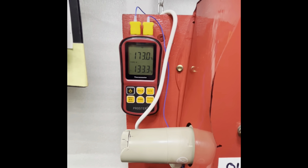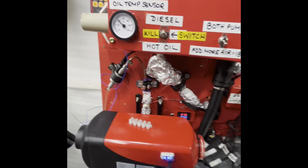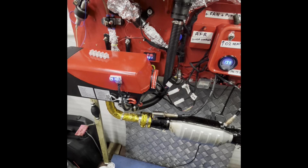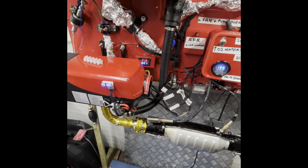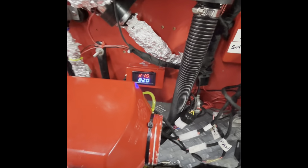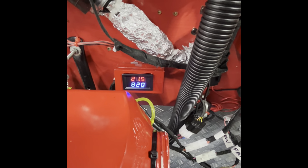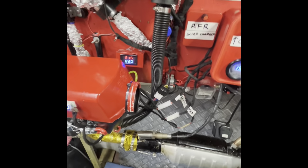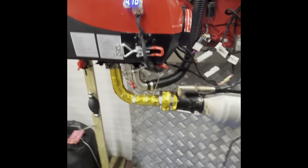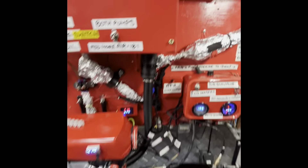Okay, so I'm on number one setting - 172 - but I've got a thermocouple actually inside the burn chamber, and as you can see it's reading 820°C. That's rated at a thousand - then it just zones out, it's not readable anymore. I've got a little bit of supercharger on, I'm on heat setting one.